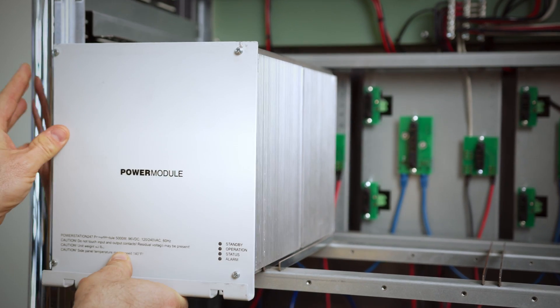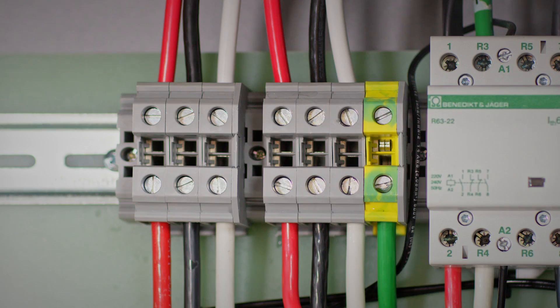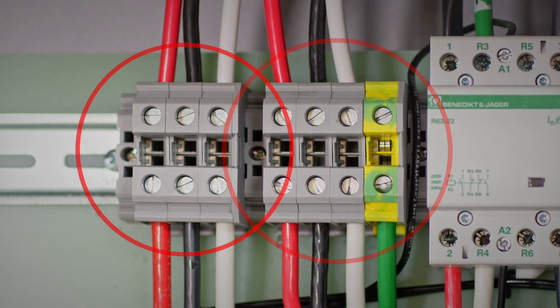Each inverter is both an inverter and MPPT string inverter. The four distribution blocks on the right are for landing the grid input — this is normally a number four wire, but comply with your electrical approved set of plans. The set of three distribution blocks on the left are for landing out-to-loads conductors that will land on the line side of the sub panel where all the circuits have been relocated.